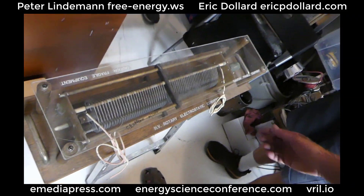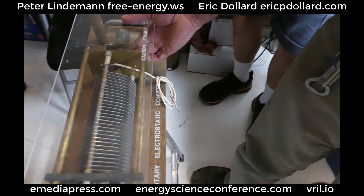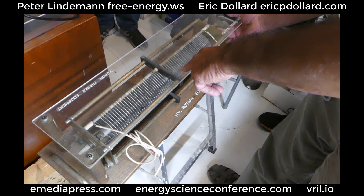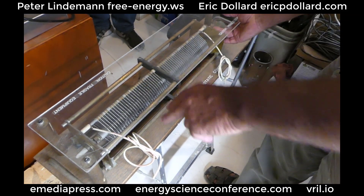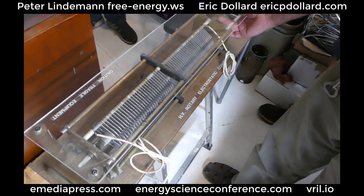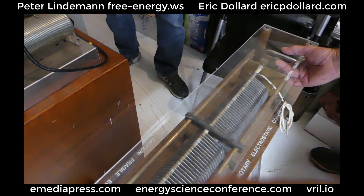So what are we looking at here? There's a stator and a rotor, so it's push-pull. There's an A stator and a B stator, and then there's a rotor in between that connects the two together. It's a high-speed variable capacitor — it increases and decreases capacitance as you rotate it. And these are 180 degrees opposite.